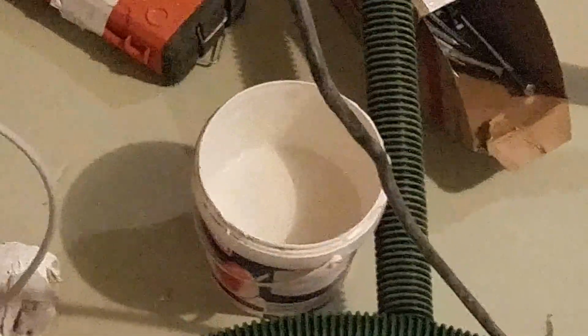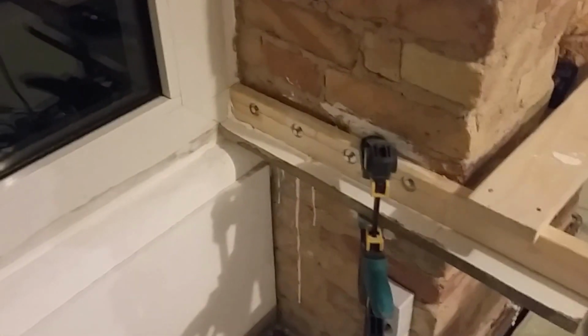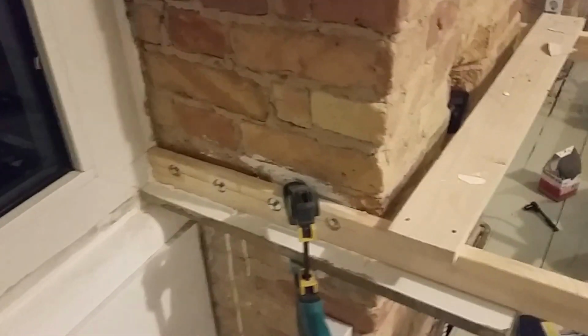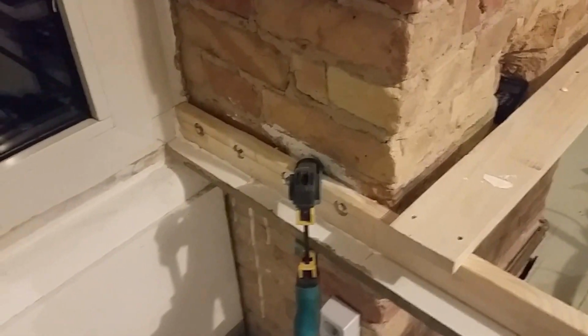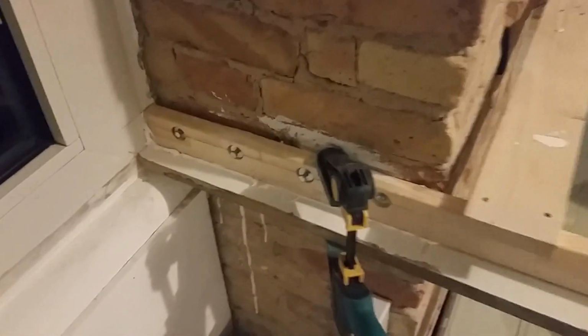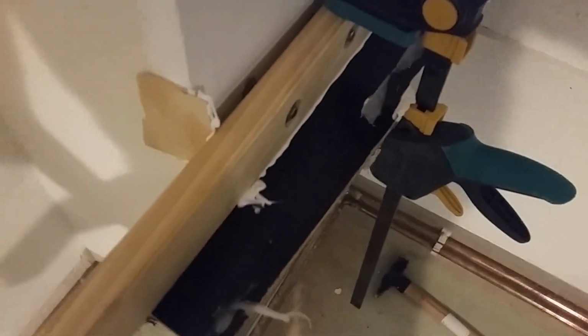And then we will pour in this contact adhesive they use for drywalling. That stuff binds really well to porous surfaces like this, especially this brick stuff and whatever. The backside of this wood, we put a little bit of flax oil, linseed oil, so it doesn't really seep into the wood. I mean, the long grain wouldn't really soak in that much, but anyway, just a little protection. And yeah, we created this mold, this thing here. We siliconed it up so it's watertight.